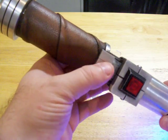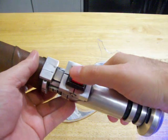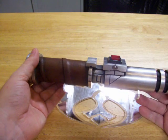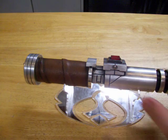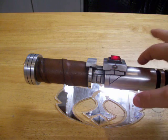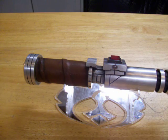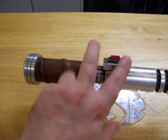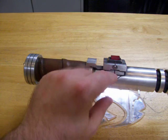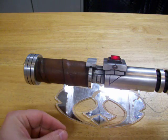This is the auxiliary switch here. No anti-power off protection. A little bit more about the electronics that were installed: the original electronics had two 16340 CR123 size batteries wired in series behind the main LED. The switches were in the same position. This was more of a plunger switch instead of a tactile switch, and that's honestly what I think broke on it originally — the actual plunger bit. That's why it wasn't working properly.